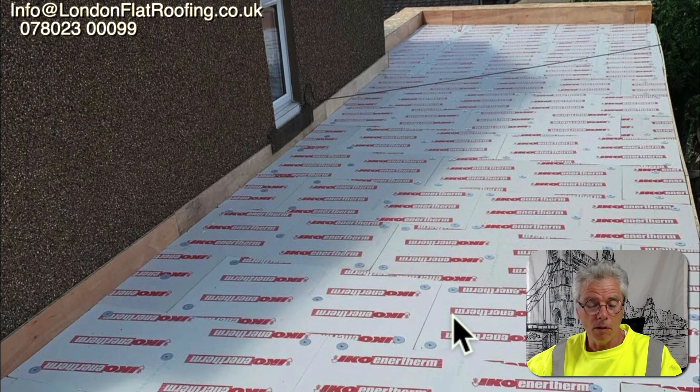Because of all these videos I do, I get lots of information and I see it from the blunt end where it all goes wrong. We take up lots of roofs where it's gone wrong, but it's very rare we take up a warm roof that has a problem. When we do take one up, it's normally around the edges where moisture from below can get up because there's no air vapor control layer underneath.